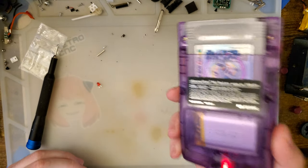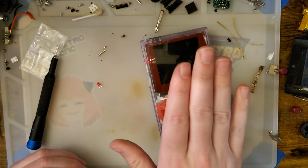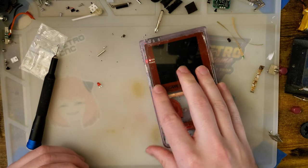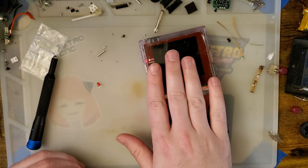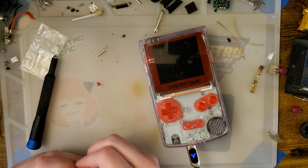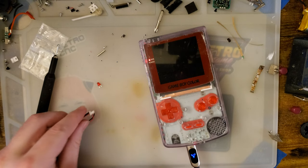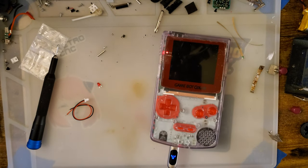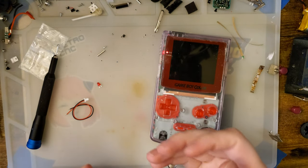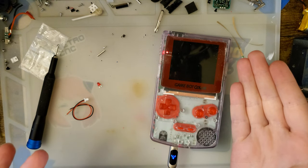I haven't checked the low voltage cutoff, but I sincerely doubt there is one. I didn't see anything in the schematic. So likely this just keeps running until whatever voltage regulator hits its low voltage cutoff. I suppose I can look that up too. One moment. All right. So this thing uses the MT3540 voltage regulator from Aero Semi.